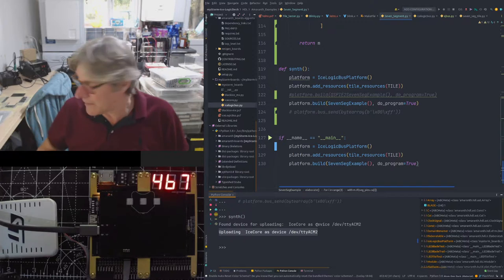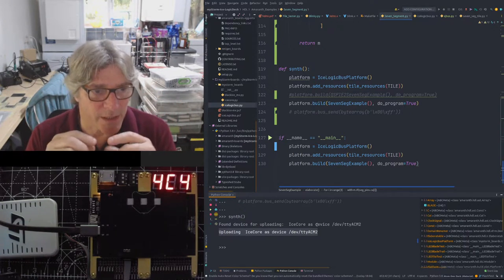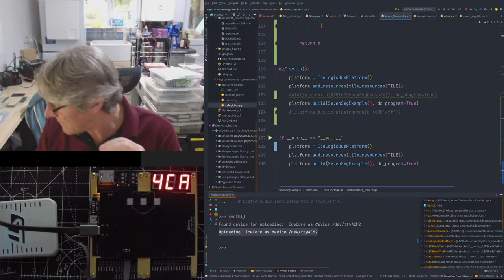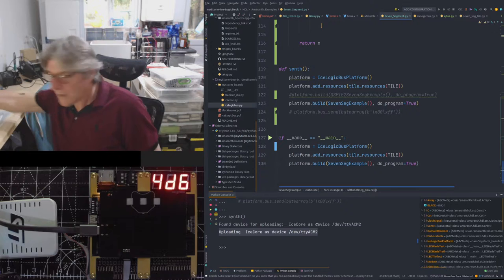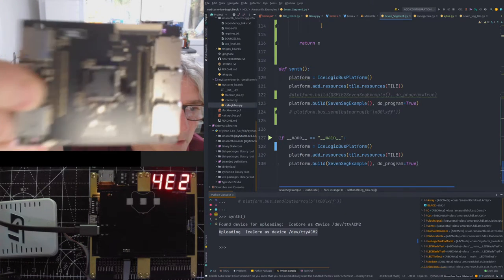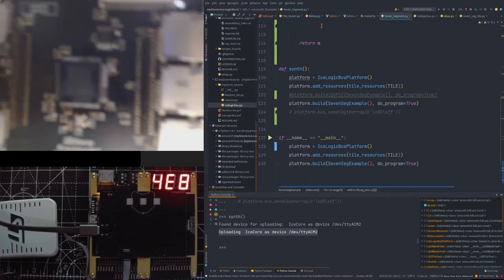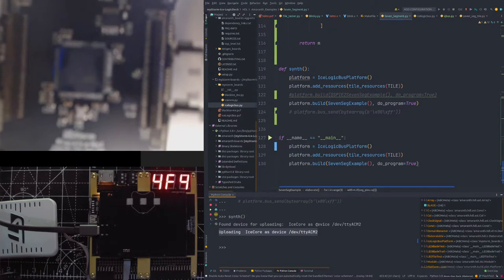Because there's definitely, you know, the big problem with the TQFPs is bridging between the pins. I don't have an example here. But yeah, if you look very closely at this, I don't know if it will zoom in, but the pins on these TQFPs are parallelly close together, but they're very long.